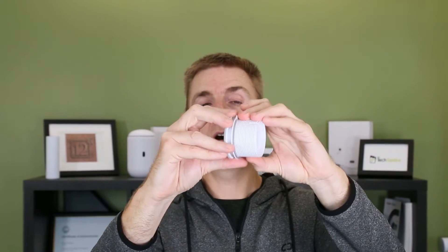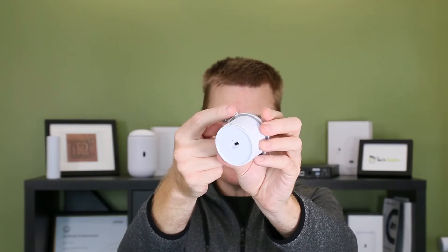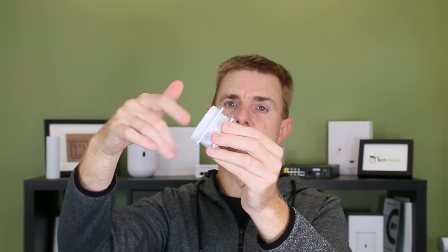You're going to cut your hole out to this size wherever you're going to put this — in the roof or wherever. You're then going to push your module in like this. It has a very small tab there. Peel this off and it's got some tape. This will allow you to push it through the void that you have in the ceiling. This will then come down the top, rotate into place and then lock into place.